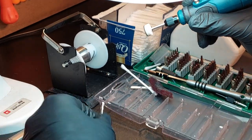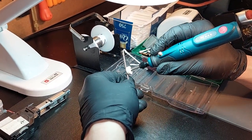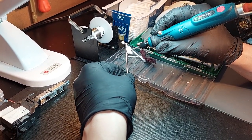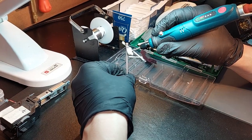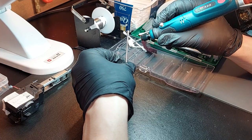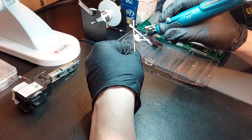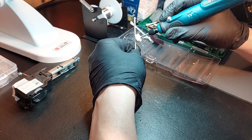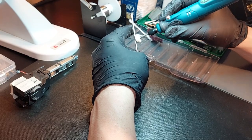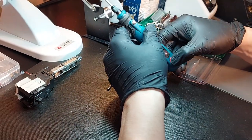Now, for the next step, you can do the entire shaft, which I recommend, depending upon what restoration project you're doing. This is a functional restoration, meaning that when I put this back into service, the cleaner this nozzle is, naturally it's going to conduct heat better, and therefore hopefully make the filament get heated better and just increase the longevity of this component. So again, I just come over here and brush it, but I'm going to show you a real quick way to once again polish this.